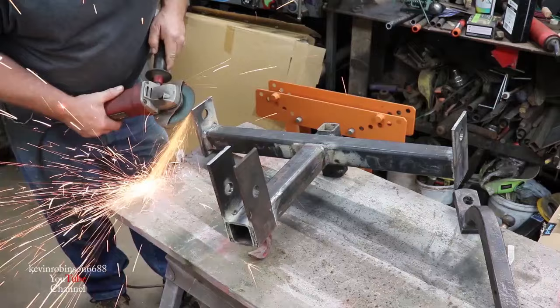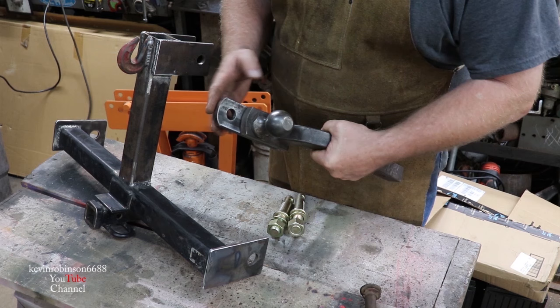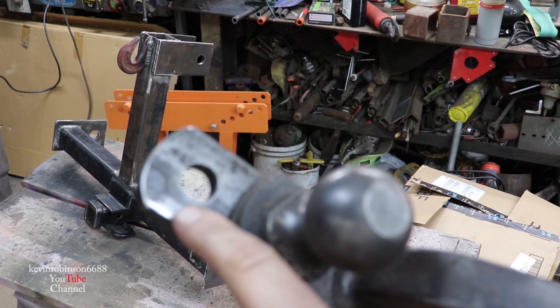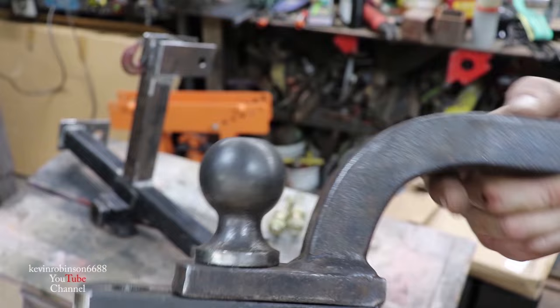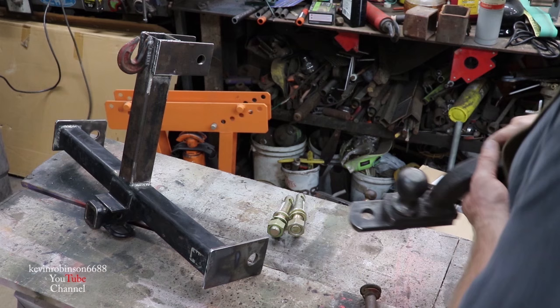This piece is finished. I cut a little bit off the top because they were too long. I cut this piece here for the bottom of my hitch - this is so I can put the brush hog on it because my brush hog takes a small pin like that. Then I'll be able to stick the trailer on here. I put a couple little tacks in the back, nothing major, and then it'll bolt down with the ball. I could use this for multiple different things - get some paint on these and we'll be done with it.